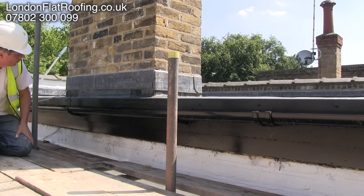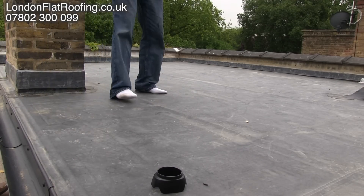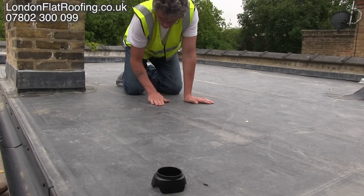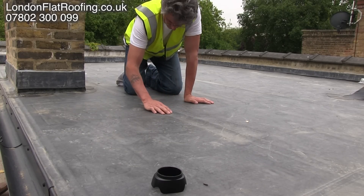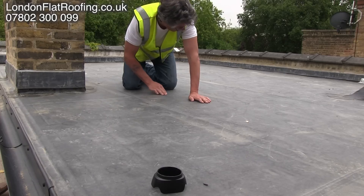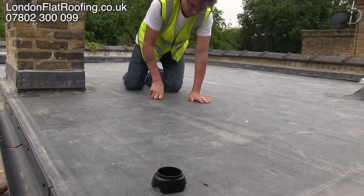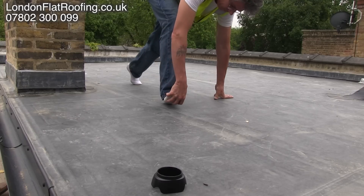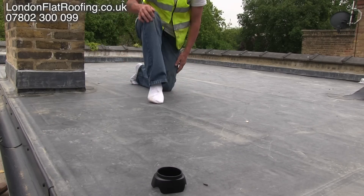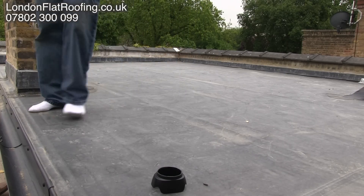Now let's have a look on the roof. The first thing that comes apparent when you go onto a new EPDM roof — especially when there's insulation underneath — are all the marks showing through. This can't be helped; it's actually part of the characteristics. We can see all the joints between the insulation and all the fixings. We can also see some slight ripples where the EPDM was laid and packed, giving a slight ridge — EPDM does shrink back slightly and those ridges will go. None of this is detrimental. If I apply enough pressure I can also slightly dent this, but it's not too much of a problem — you just don't want to be wearing shoes with any sharp points. Thank you for watching this video; I hope it's been a help to you. My name is Stephen from London Flat Roofing.